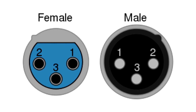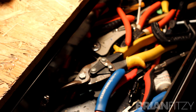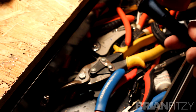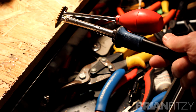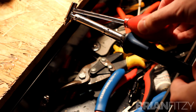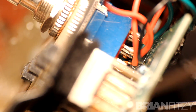If you solder those two pins together it ain't gonna work. In conjunction with my soldering pencil I use one of these to desolder — don't. They're terrible. Spend a couple more bucks and get one of these: it's a soldering pencil with a built-in hand-operated desoldering pump. If you own a motorized desoldering gun, I can't think of any reason why you'd be watching this video.